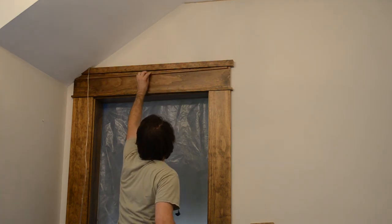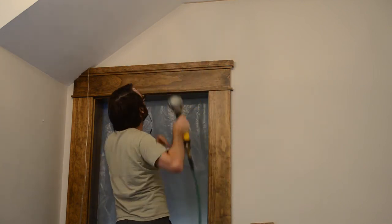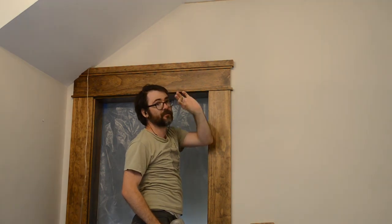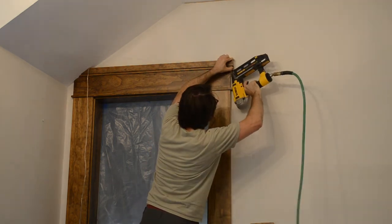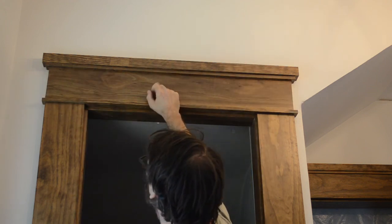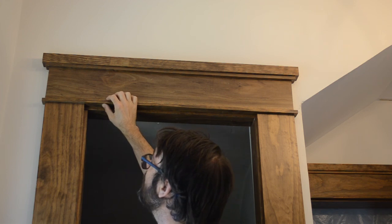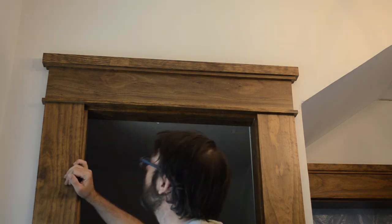I made a half-inch square bead and put it on to wrap the corners. You need small pieces — hold on to all your little offcuts because you need quite a few tiny pieces to finish off the corners. For a more normal door without stairs protruding, you get an inch on either side of the two-by-two block, then the half-inch bead wraps around to clean it up. For the bead, consider using brad nails that are a bit finer and shorter than the finish nails used elsewhere. If it splits, use smaller nails.